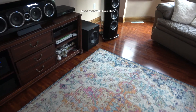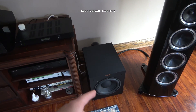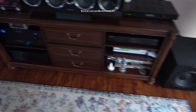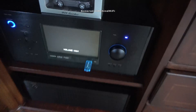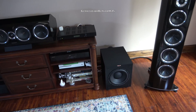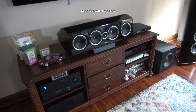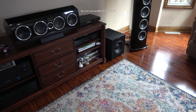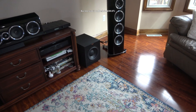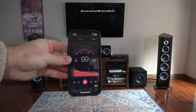I'm getting ready to run Franken-Klipsch, and I just want to let you guys know that I don't think this amplifier is powerful enough to bring this subwoofer to distortion. I cannot hear any distortion at all playing the Doom intro scene with everything maxed out — my processor is maxed and the gain on the amplifier is maxed to plus 9, that's as loud as it can go. So even with everything maxed out and not being able to bring this subwoofer to distortion, I think you the viewers will still be impressed with the output numbers. Even if I were to purchase a bigger amplifier, I think the output results would only change by a dB or two. I think Franken-Klipsch is very close to its max output judging by the excursion coming from the driver, but unfortunately we won't find out with this amplifier.